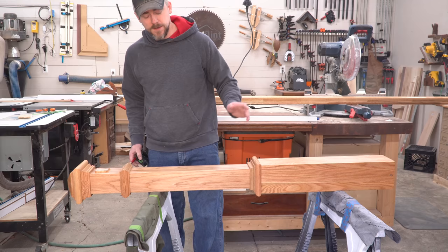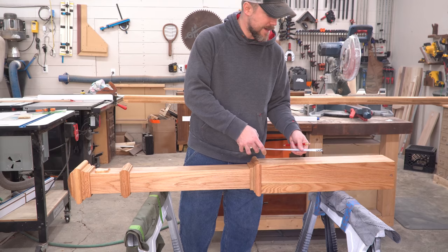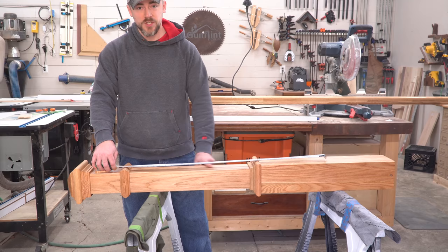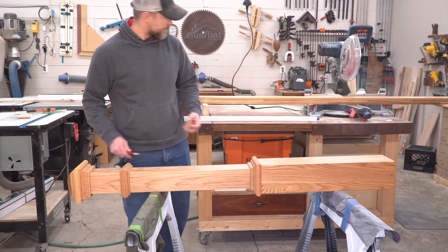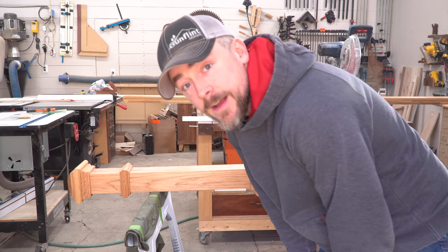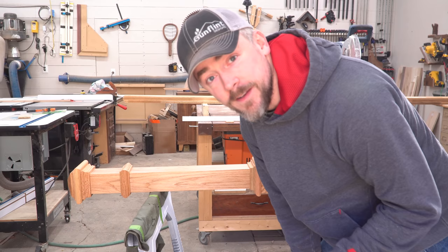The other thing I need to know for sure is that I need a flat spot 25 inches up from the bottom for the angled handrail coming up the stairs to anchor into. If I cut at that mark and measure here, 25 and a half falls right in the middle of the giant flat spot — so all of our bases are covered. I can go cut this thing and feel pretty confident that I didn't make a big mistake. I would like to point out I have no idea what I'm doing. I'm making this up as I go along, but making sure that it's up to code and safe. The process by which I get there — I don't know, we'll see what happens.